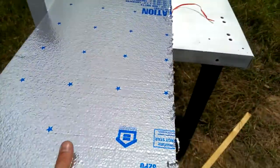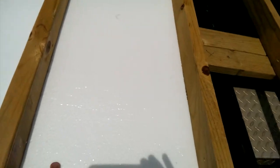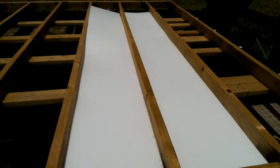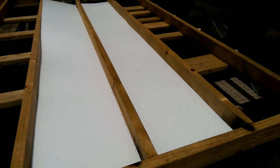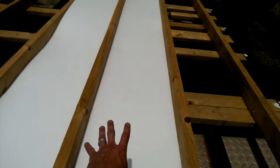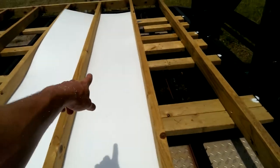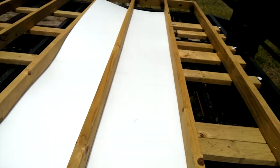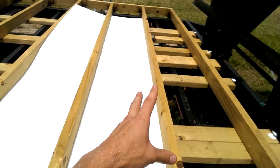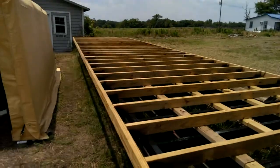I'm just cutting them to 14-and-a-half inches, or a little bit over that, so they kind of smoosh in down here for my foundation. We'll probably put about one-and-a-half inches down here. In Texas the climate really doesn't get too cold in the winter, so this is a nice wind and thermal block. There'll be a little bit of an air space between that and the subfloor. The plan is to put down these insulation panels, then spray foam around the inside border all along the edge, and then stick another panel on top, kind of sandwiching it in place. The spray foam will seal all the edges.